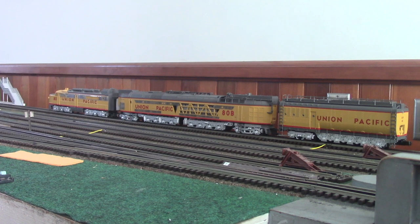The other difference is that this has a different chain file. There's no chain file compatible for this locomotive to be set up in any way. As mentioned, the PS3 run that came out late last year has no chain file. The chain file is used for talking to all the motors for the slave boards. So the only way this model could run was that they would take the chain file off the rear turbine, because there are four motors, two in the A and two in the B unit, in order for the master slave board to function correctly.